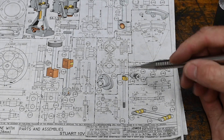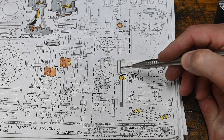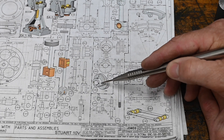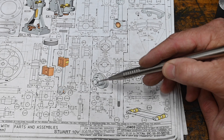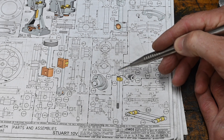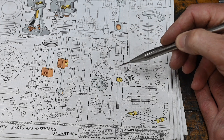Today we're going to be making the eccentrics for the forward and reverse. These two are in fact coupled together using the same centre line, by a couple of two millimetre dowel pins, and then it's held to the crank by a couple of little grub screws. I'm going to make this one first because that's the easiest one, and then we'll have a look at the other one and work out how we're going to do that one.